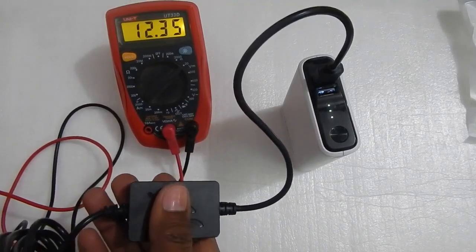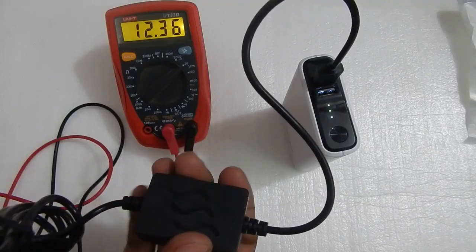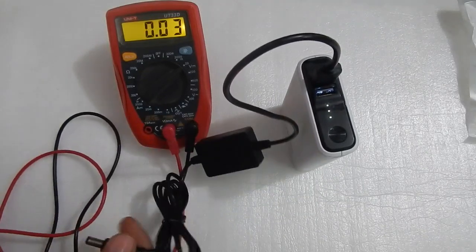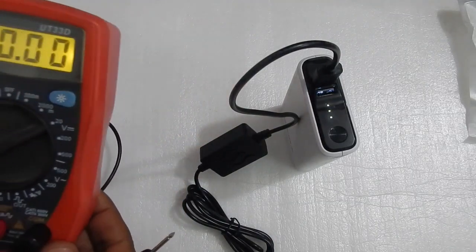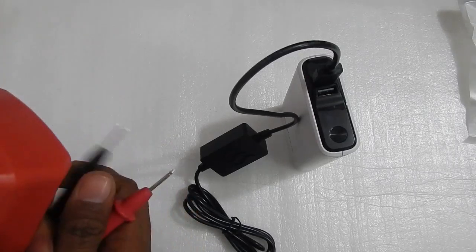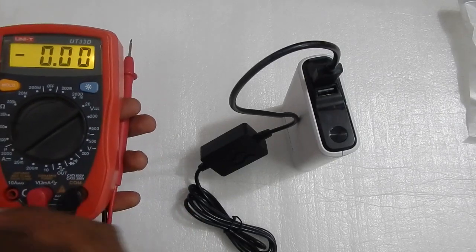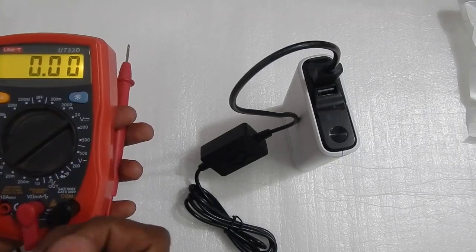While using it for a couple of days now, it gets a little warm but it is working and doesn't get too warm, so I think it should last much longer. You are easily able to power any 12 volt device which takes about 1 amp or less. You might still be able to run a load that takes more than 1 amp at 12 volt, but you may find issues — modems or routers that take more than 1 amp may turn off or shut down because they are not getting enough power.